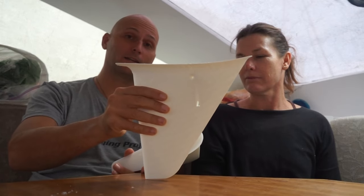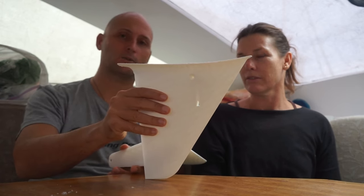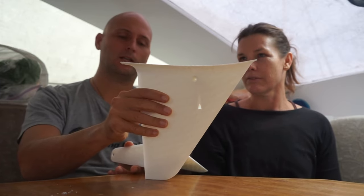That would be cool if it can do that. It does it, but it's all size related. And these are primarily there to stop the tip vortex — to make the rudder more effective. So that means this is like making the rudder longer. Because when the water rushes from one side to the other, you lose that much rudder because the water's running the wrong way and the pressure is not working. So essentially, this is like gluing this to the bottom of the rudder and making the rudder that much longer, without the penalty of having a deeper rudder so we can stay in shallow water. That's an easy way to look at it.